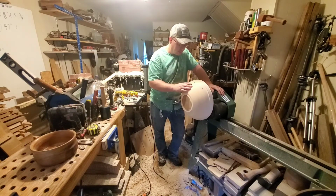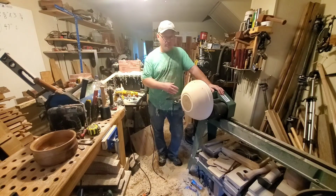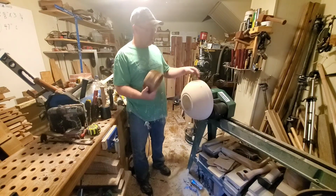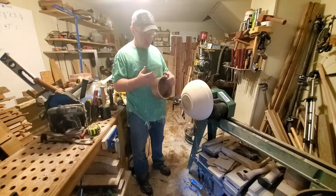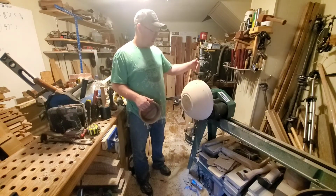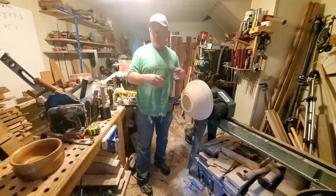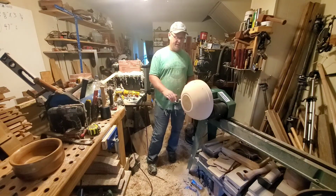And I didn't really know if I wanted to throw this out there yet because it's not finished. I've had bowls like this explode on me in the finishing of it. Like you get it pretty much like this right here, and you see this has got cracks in it. When you start turning that inside, cupping out the inside of it, it really will start drying out pretty quick. And just overnight, you'll start developing these checks in it, these cracks. And so you end up having to put CA glue in there, and it ends up being a heck of an ordeal sometimes, just stabilizing it, and it'll warp. It won't be perfectly round when it's done probably, unless when I go to finish it up, I go and turn the outside again.